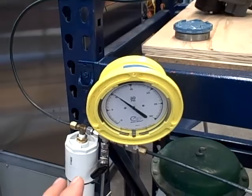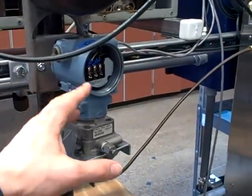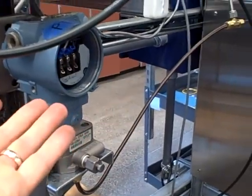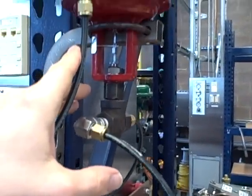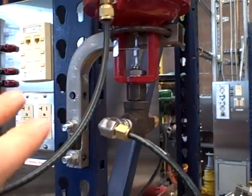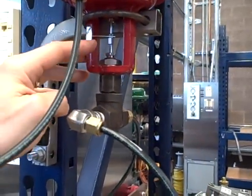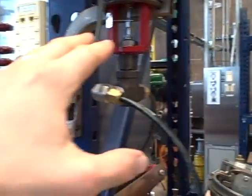What we've done here, though, is include feedforward control by placing another transmitter that simply monitors the incoming air pressure. If this transmitter sees a rise in supply pressure, that feedforward signal gets sent to this valve to pinch it off. We have a feedforward summer in the controller program with a negative gain, so when it sees a rise in supply pressure, it works to cut down the position of this valve.